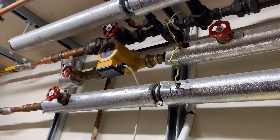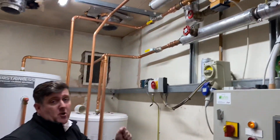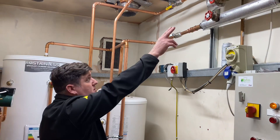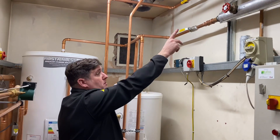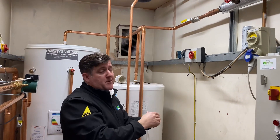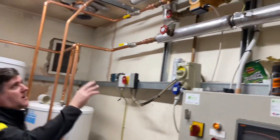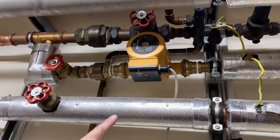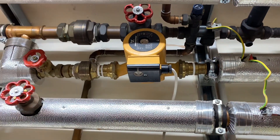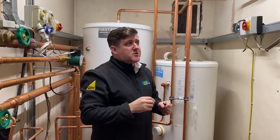What's that pump there? This here is the hot water return pump. In commercial properties — schools, care homes — you have a hot water loop. That pumps hot water all the way around the building constantly, so when you open a tap you get it quickly. So it comes out and back in and pumps back in — it's a hot water return. Very standard within the commercial world, and some large houses have them too.